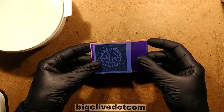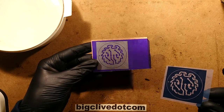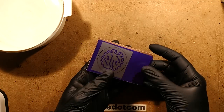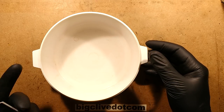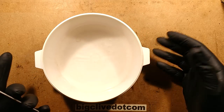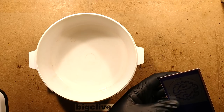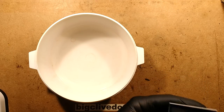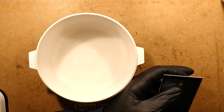The material has now been exposed for exactly one minute and when I remove the transparency you'll see a distinct colour change — very vivid — it goes dark wherever it's been converted into hardened resist. The next step is to get the developer. The developer is just a mixture of water and some sodium carbonate, otherwise known as washing crystals or laundry crystals. You'll find it in most supermarkets in the laundry section.